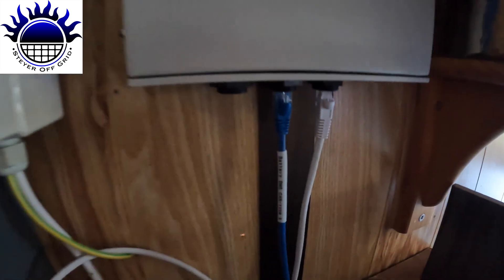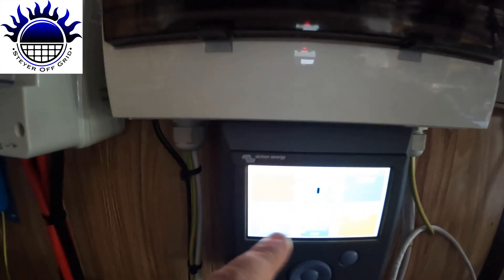I re-terminated all those cables since I had CAT5 cable and RJ45 terminals — but it still didn't work. Then I read that Victron recommends using their own cables, and I thought CAT5 is CAT5, RJ45 is RJ45 — but they're not the same. This Victron cable is special: the terminations are different from normal, and it has to go in a specific orientation — one end into this port, the other end into that port.